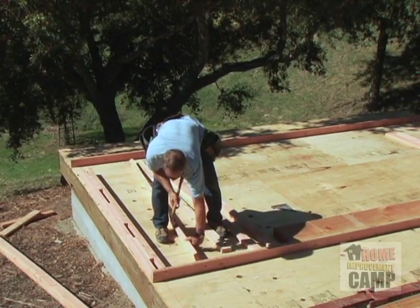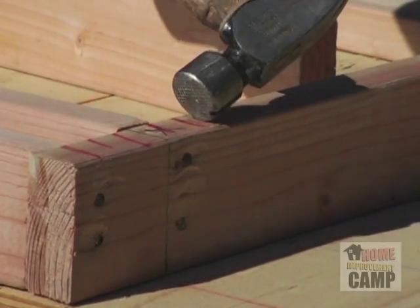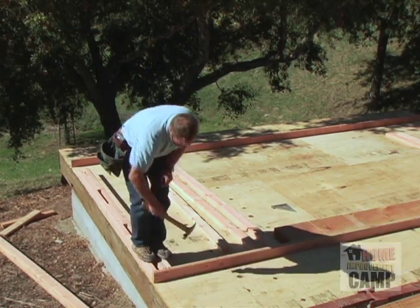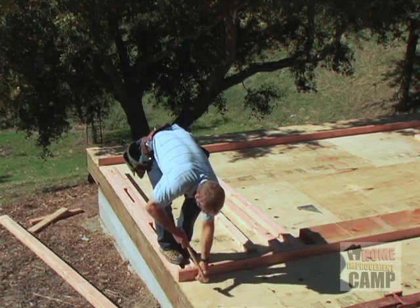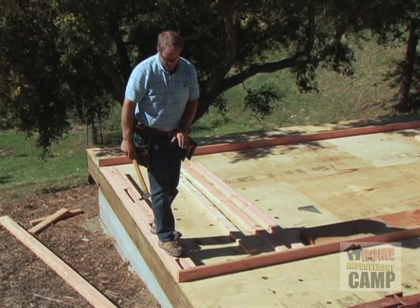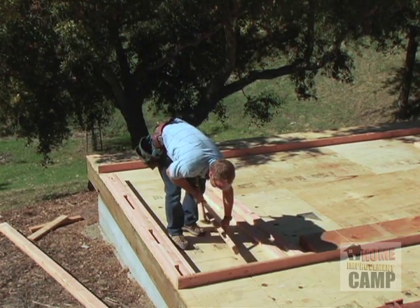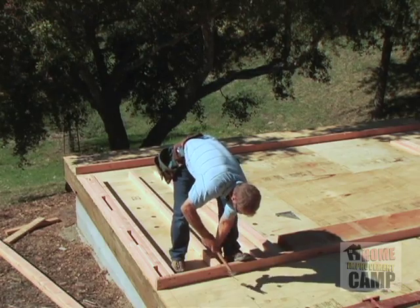You see that right here I have a layout. Now if this piece of sheetrock comes over here and lands on the center of this, it's just going to fall through. So I'll lay that stud right there to cover that up. And sometimes when you nail, your stud will pull off the plate a little bit - just tap your nail a few times and it should suck that right up. Now it's just following your pattern.